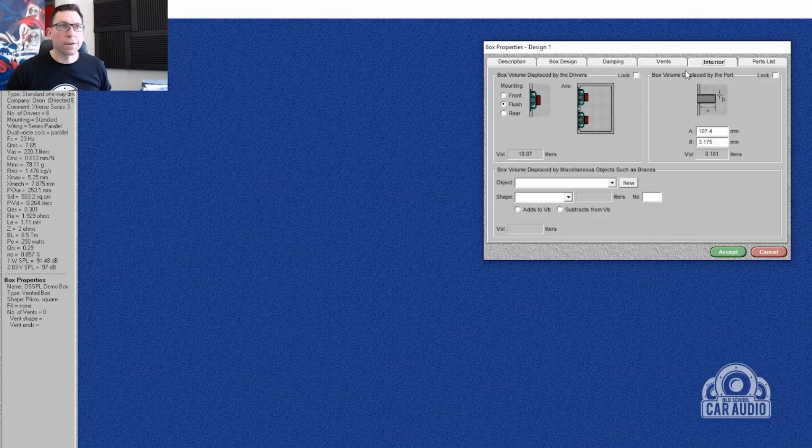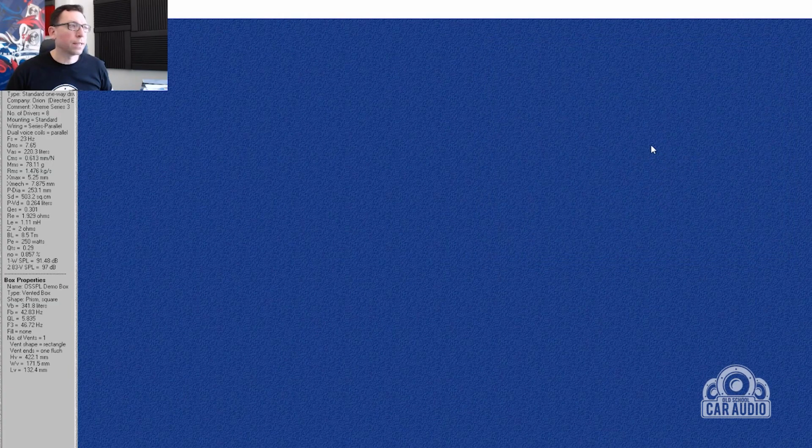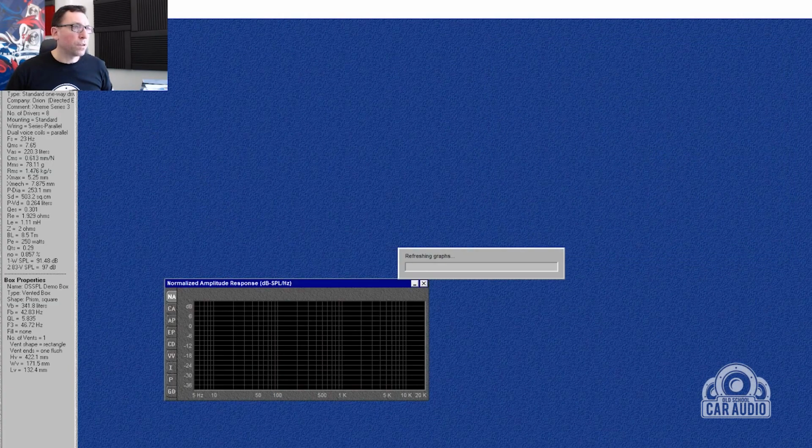and my box volume displaced by the drivers. Yes, because they're flush, and this will calculate that, plus my vent. So I'm going to put a small brace in there, but it'll be so small it won't really displace any of the volume. I've got a cut list there generated, so let's just accept all that. Let's plot a graph,